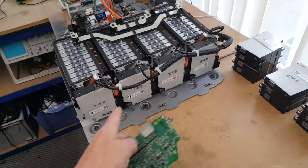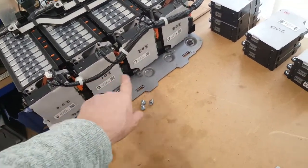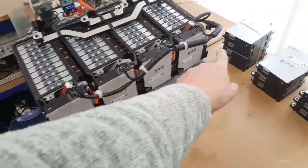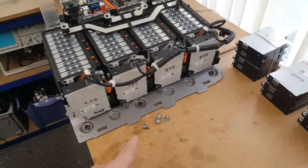These boards are not identical — they're in pairs, and if you plug the wrong connector into the wrong board you will get magic smoke. They're not all interchangeable. You can only interchange A with C, and D with B, if I remember correctly, but I'll have to check my notes on that.